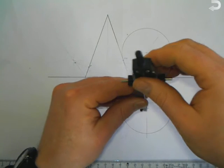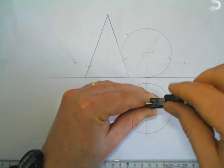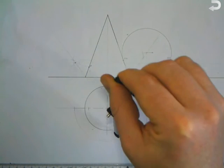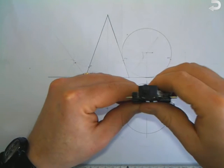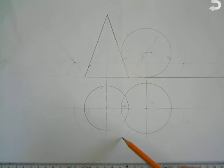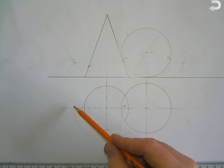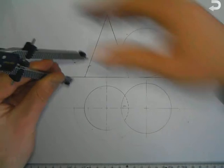Then what we're going to do is rotate this sphere around the other sphere — we take the centre point of our compass, put it on the centre point of the original sphere, and rotate around to our new sphere. We also take our point of contact and rotate this around. What we've now found is this point here — our centre point in plan in its correct position. This is the same as taking the sphere, rolling it around, and where the two centre points meet, that's our centre point. Now we set our compass to 20.